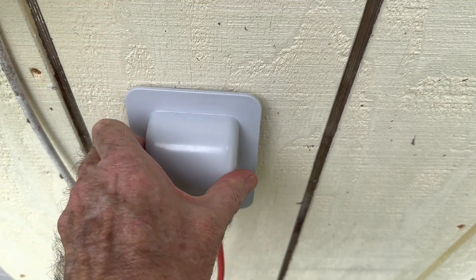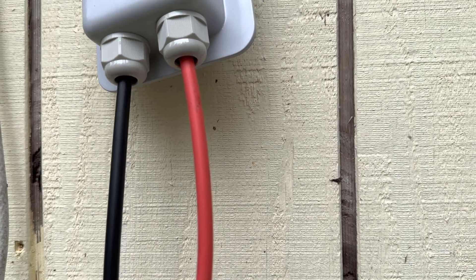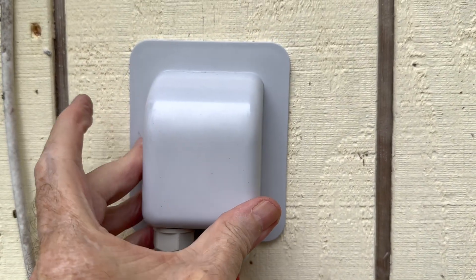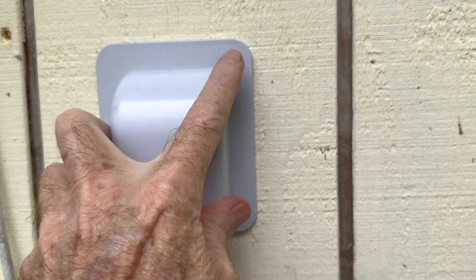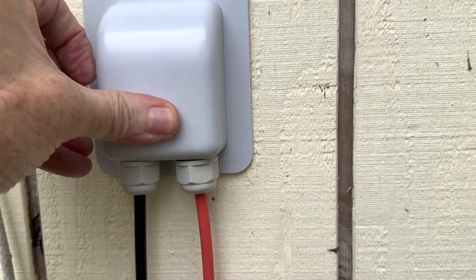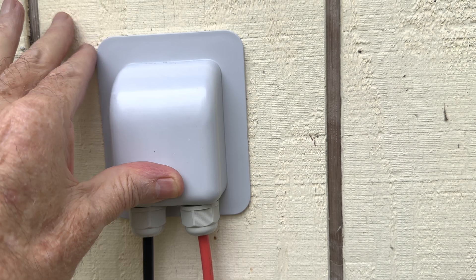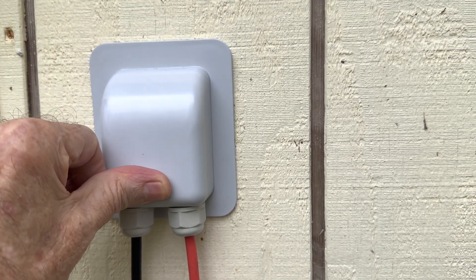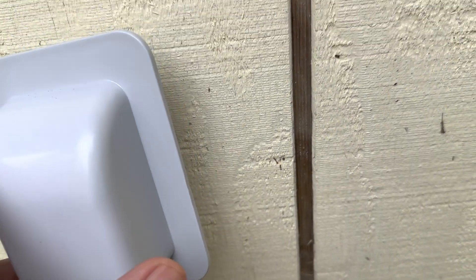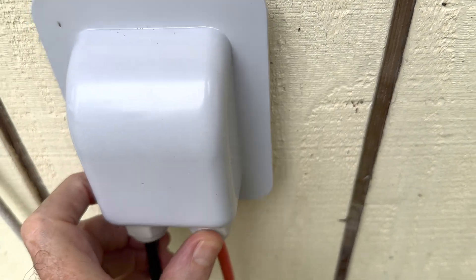Now that the system is completely installed, the last thing I'm going to do is screw in this pass-through gland where my solar panel cables are coming in. Very nice, tight fittings underneath — this will push up against the wall. I'll drill about four screw holes, one in each corner, tighten that up to keep any small insects from crawling up and getting into the wall. I use these all the time whenever I'm passing something through a wall — they work fantastic. This side of the house can take a beating with rain and it's not going to affect anything. Come out here with the screw gun, tighten that up, and call it good.